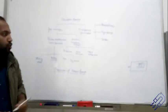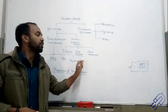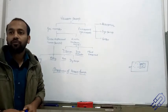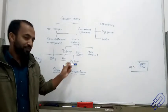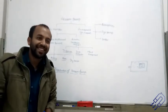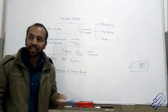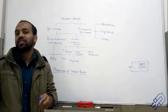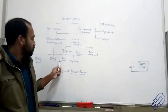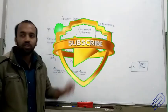After the rotary pump, if you want more vacuum, a diffusion pump is mostly used. There is also the turbo molecular pump — as the word 'turbo' suggests, it helps you achieve ultimate values. If you want to achieve ultra high vacuum, you need a combination of rotary pump, diffusion pump, and turbo molecular pump — all three. Most vacuum systems used in research will be using one or more of these three types.